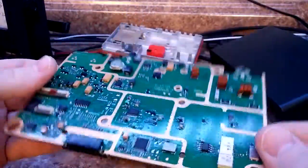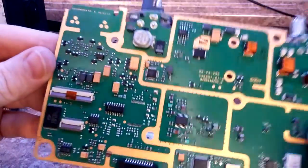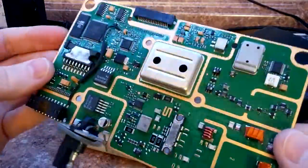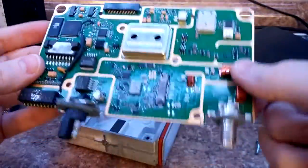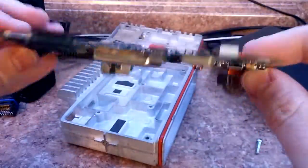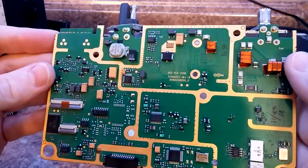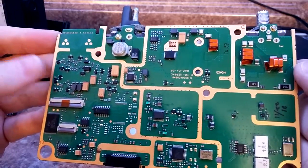So that's it. Look how easy it is to work on this — I wish half the stuff was this easy. Hot air stations used to be $1,000; nowadays they're significantly cheaper. You can get decent ones from China for the hobbyist, and that's really all you need. To say this is not an easy-to-work-on radio is ludicrous — it's supremely easy. I've repaired a number of these. Full schematics, parts layout, and even theory of operation are available.